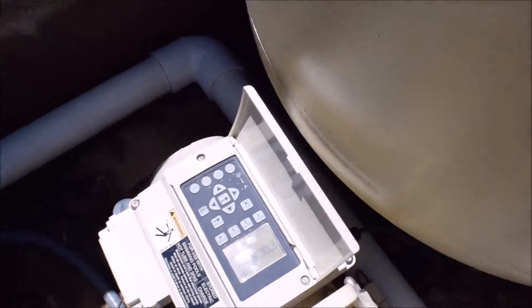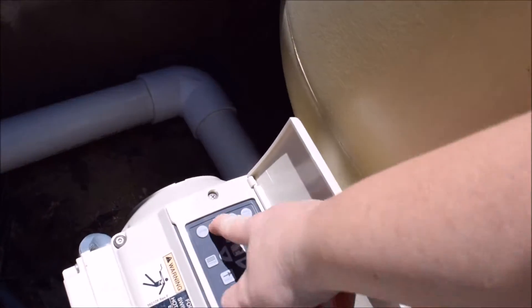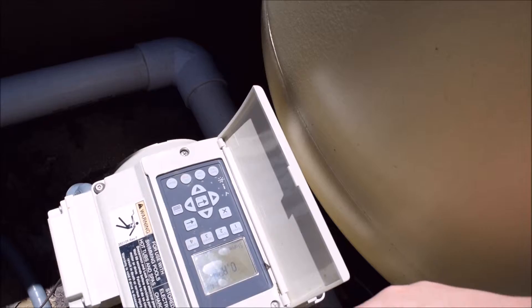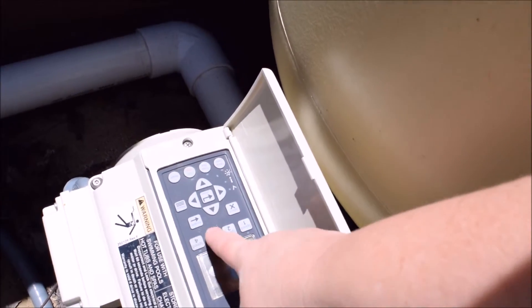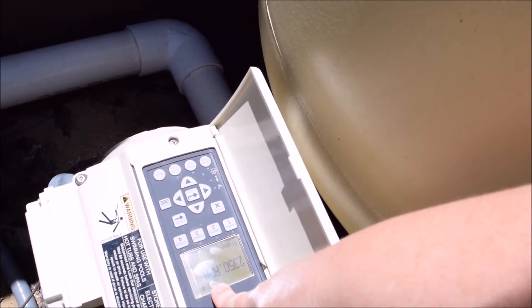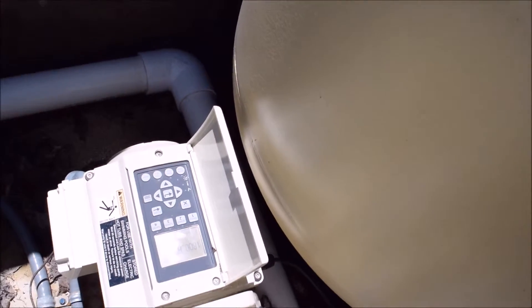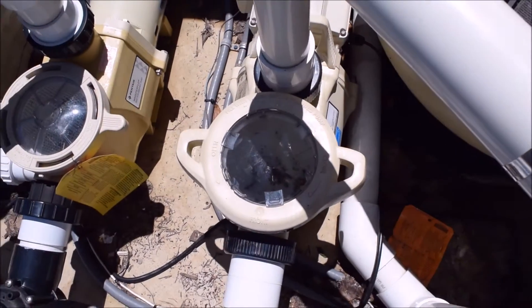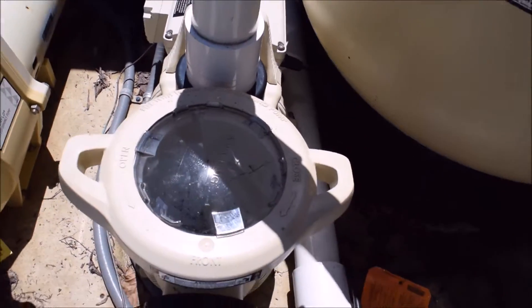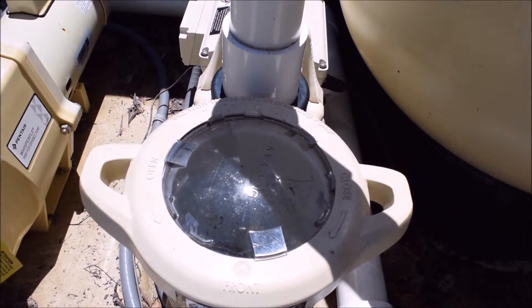If the pool is in service mode, you can also control the pump through the panel on the back. To stop the pump, hit the start/stop button. To start the pump, hit speed one for super slow, two for medium slow, or three — which is what we normally want at 2350 RPM. Hit number three, then hit the start button, and wait for it to prime until it's back to fully operational. Normal operation means no air is getting into the pump — it almost looks like you can't see anything other than a little debris moving around inside.